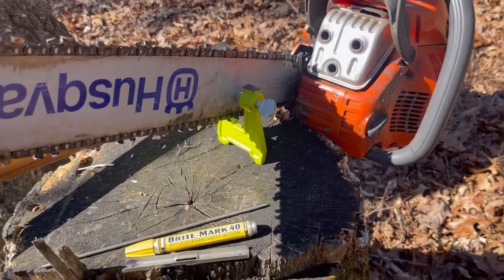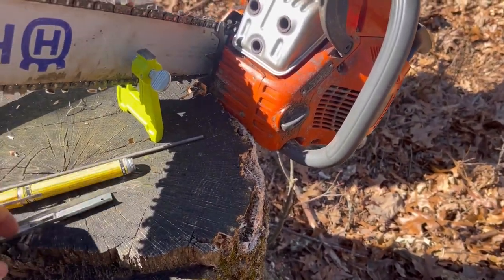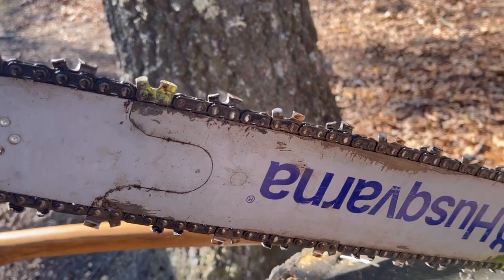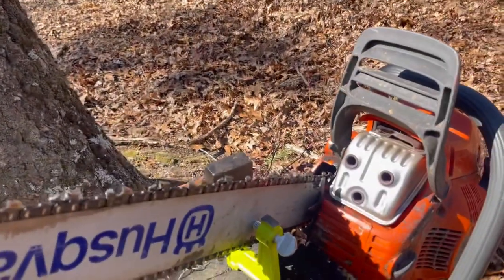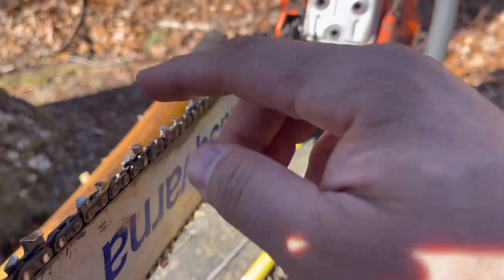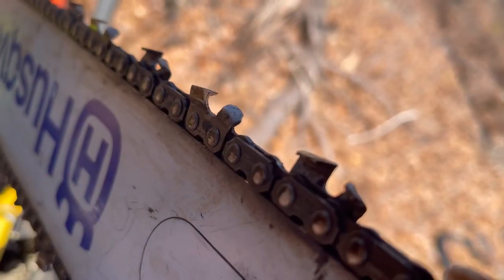So now you want to freshen it up in the field. This is sharpening the chain the easiest and fastest way. You're going to use one of these chainsaw sharpening files. Get yourself a marker and mark one of the teeth so you know where you left off. As you continue to file down the chain and come back around, you'll know where you stopped and won't keep filing the same teeth. Down the chain you have these teeth — this front part is the depth gauge and this is the tooth that actually cuts. They face different directions so they cross-cut into the wood.